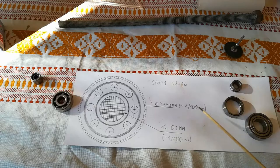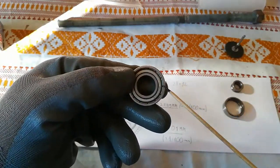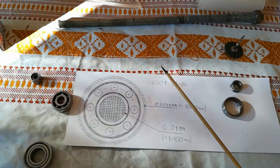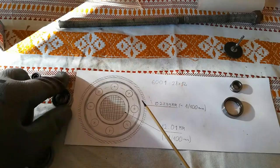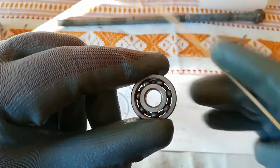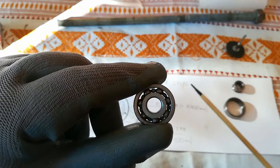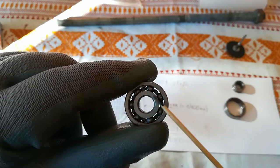Let's see how we can dismantle them. Most bearings have shielding. Shielding can be from one side, it can be from two sides, it can also be rubber shielded like this, or it may be an open ball bearing like this one. Once we have removed the shielding with a knife — maybe use a screwdriver or something pointing sharp — we are left with bearings, crown and races.